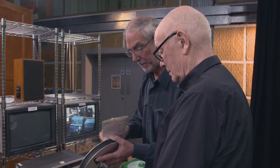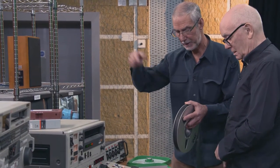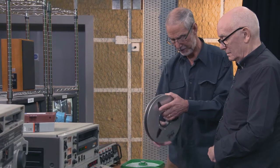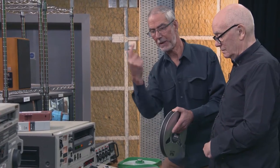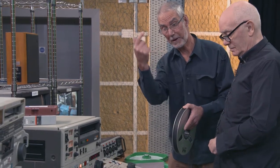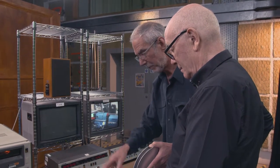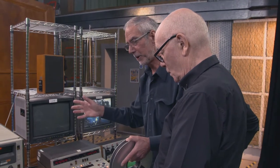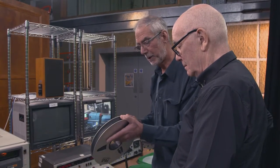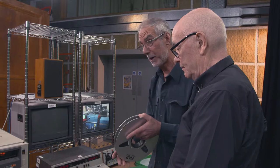This marked a big change from the quads, because the quad was a transverse head going at 90 degrees to the tape direction. The one-inch was a helical machine — like your VHS or everything you know now tape-wise — where the head drum basically revolved in a similar direction to the tape, so the tracks were laid down on a slant, a frame at a go effectively. That meant if you stopped the tape you had a whole television frame. So lo and behold, from two-inch where you could not see the picture when you stopped the tape — which made editing something like boxing very difficult because you just had to guess — you could now stop the tape and see exactly which frame you wanted, and mark your in very precisely.